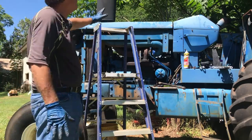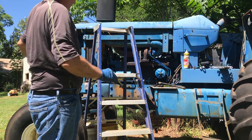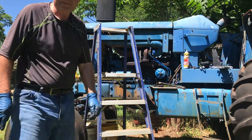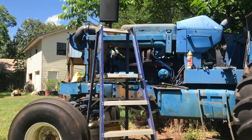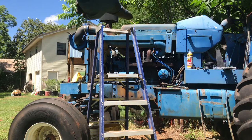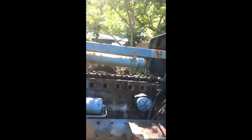There's a rubber grommet on here that's stopping me from taking the top off, so I had to go get some more tools. Once it comes off, the whole top will slide over the exhaust pipe, because right now the exhaust is really stuck to the pipe. Okay, so the top is off. Next I'm going to take the gas tank off — four bolts and a tube over here, and of course underneath there's a shut-off valve, so I'm going to shut that off and take the hose off. Hopefully the gas tank is empty.